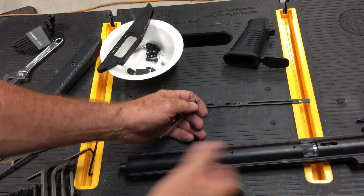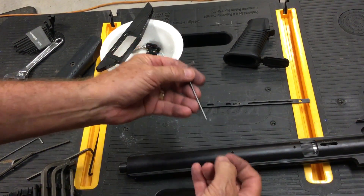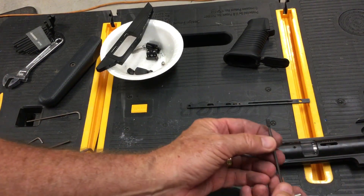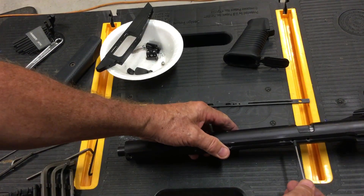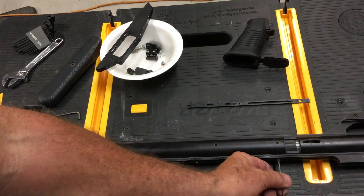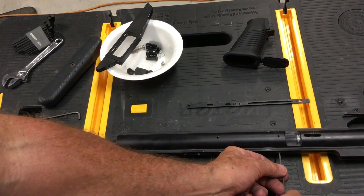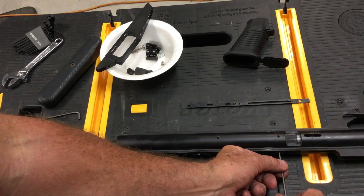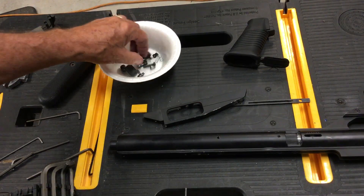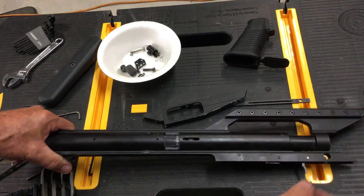The assembly is locked back in place, so now everything is back together. Let's continue — put our next one in. Now, there are set screws: the long ones, because you have long ones and short ones — the long ones go in the bottom of the frame. Because of this extra material down here, the set screws have to pass through that and go into that part of it. Then just continue putting the gun back together. That is the order that everything goes in.